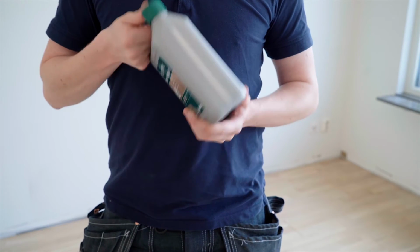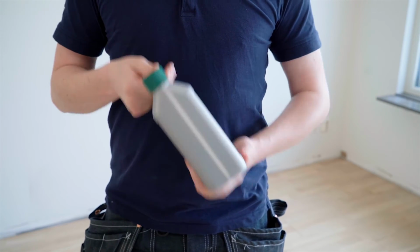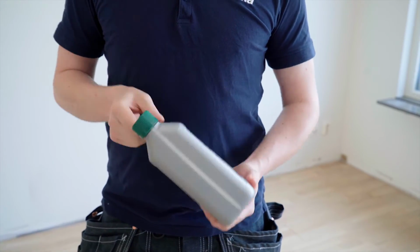You don't always need to fill the gaps in the floor, but it gives the surface a finer, more professional impression. The joint filler is intended for small gaps between 0.1 to 2 mm and on floors that are dimensionally stable. Shake the Bona gap filler container and mix its contents with the wood dust you collected from the medium edge sanding.